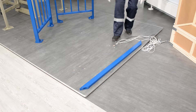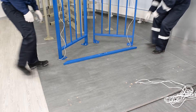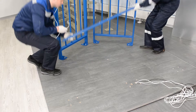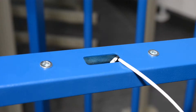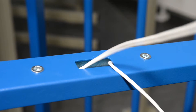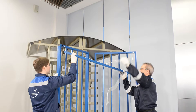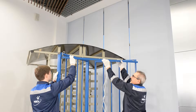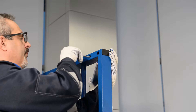Place the supporting girder so that the square hole in the middle is facing up. Lay down indication cables one after another from the guide barrier section to the supporting girder and route them through the central hole. Fasten the supporting girder on the guide barrier sections with four M8x16 screws. Use SW6 Allen key. Apply waterproof silicone sealant at the place of connections.